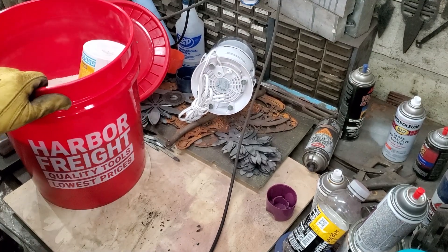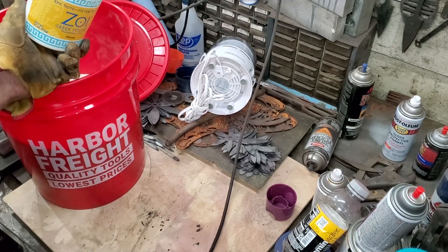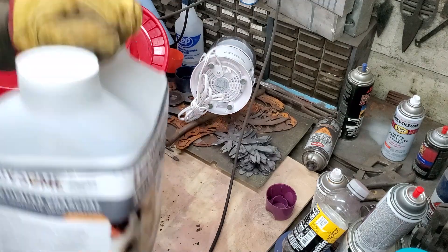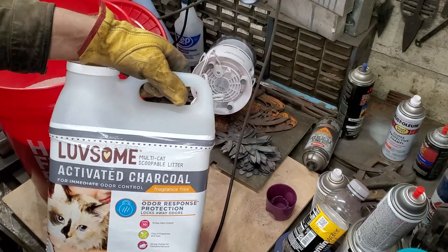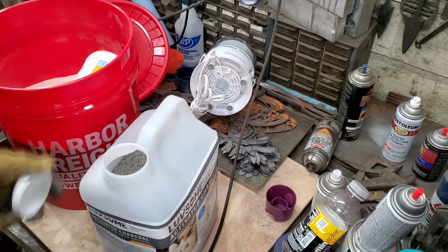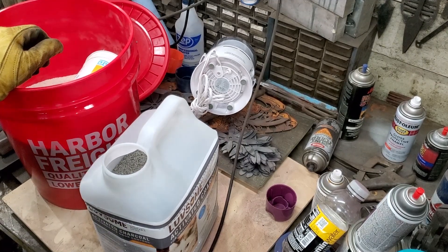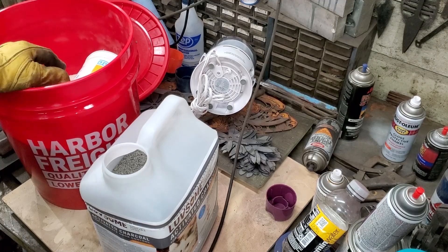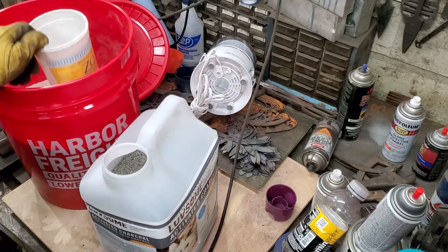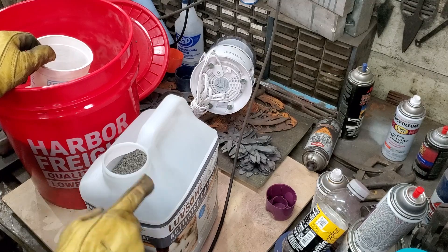In our Harbor Freight U.S.-made bucket, I have 10 yogurt cups of regular sand, because I'm making a green sand. It's water-based. And I have here some cat litter — it's got activated charcoal in it. I don't think that's going to matter or affect the quality of the sand at all, just having a little carbon in it. The ratio for green sand is going to be 10 parts sand to one yogurt container full of this bentonite clay and activated charcoal. But I need to powderize this.